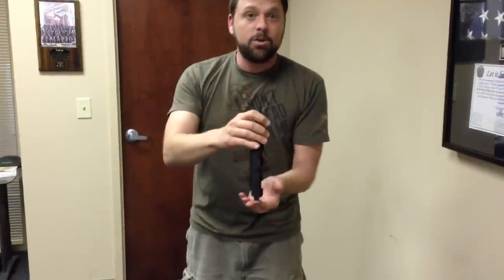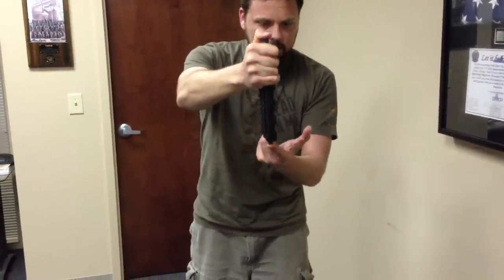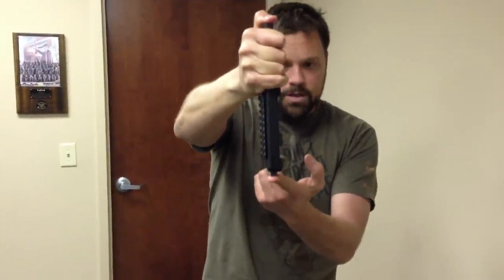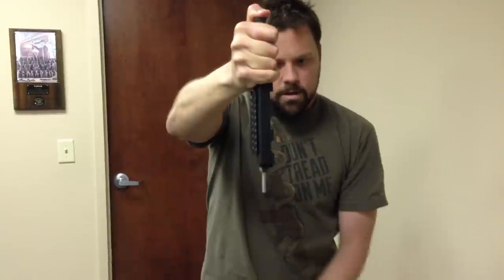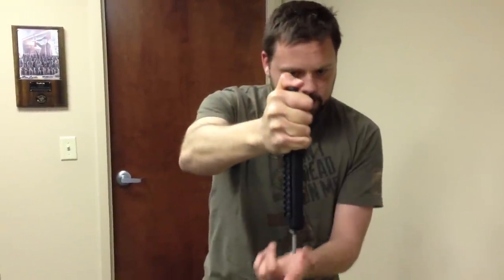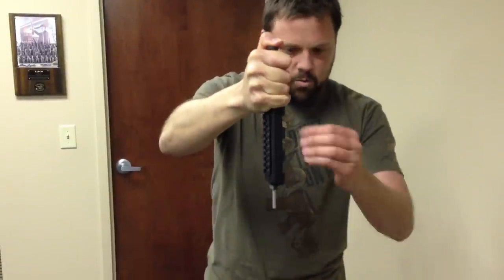If it's a proper diameter for both the piston and the gas tube, I'm going to put my thumb here, cover up the air, and you'll see gravity pulls it down, but it's slowed because of the lack of airflow. So with my thumb on it, if gravity will pull it down but slowly, then you know it's a proper diameter on both the piston and the gas tube.